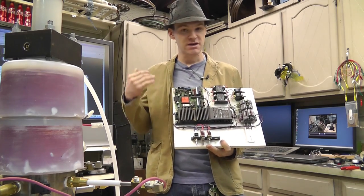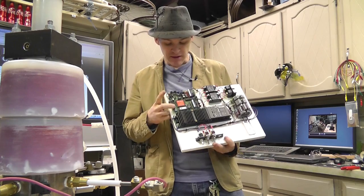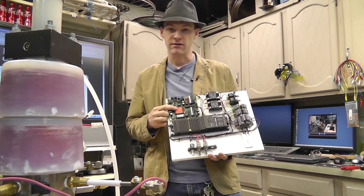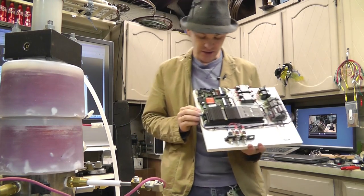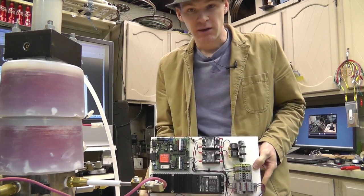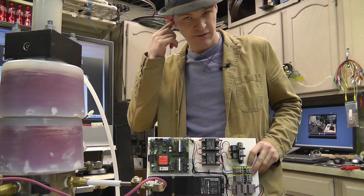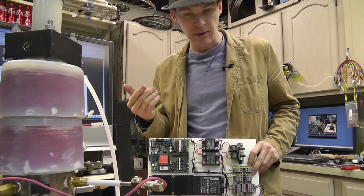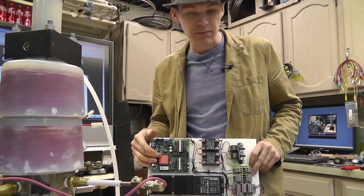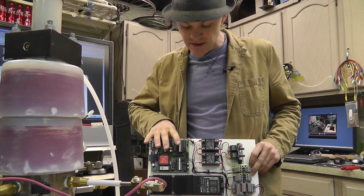I can do PLCs, I can control ladder logic, I can do that stuff. I do that on a daily basis. This also has scripting in it. This particular controller has scripting. So what he's done is he's created a program that uses slight ladder logic and the rest is scripting. So I have to learn the scripting logic a little bit better, but I do understand it and I know how to manipulate it, so I'm good for now. But this is basically our new controller.